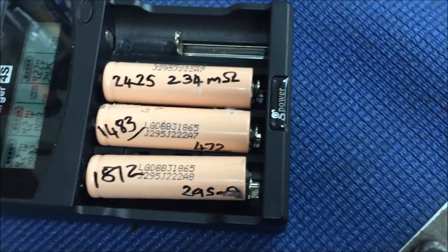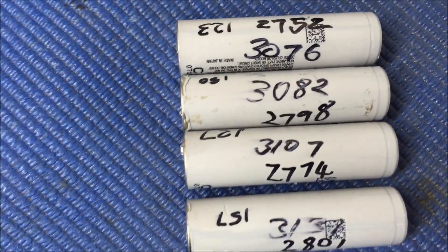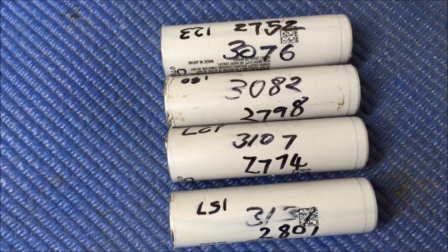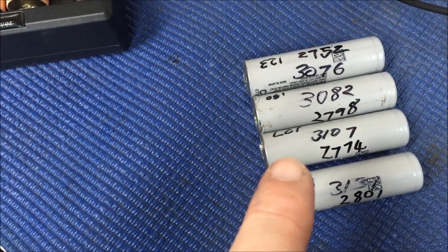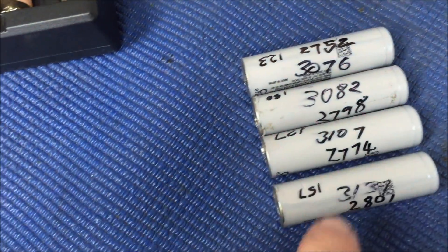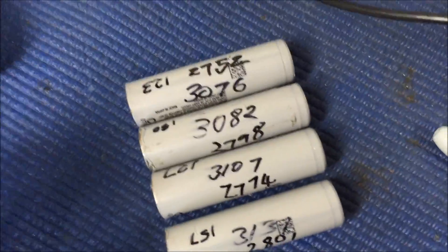Any other packs I have to take apart for maintenance, I'll check resistance again as well. Now these ones — I'm going to sit back and cop one on the chin because it looks like I must have stuffed up somewhere. They were all 3000 milliamp hours — I didn't write it on there for fun. But these have a button that changes the draw between half an amp and one amp. I tested those cells at half an amp and they came out at 3000, then at one amp they came out at 2827 and 2727. So it looks like I did something wrong with those cells. Not the end of the world, but I concede defeat — I messed it up.